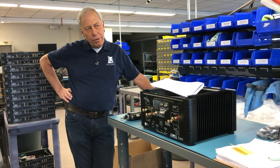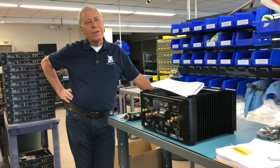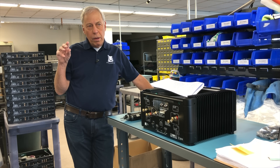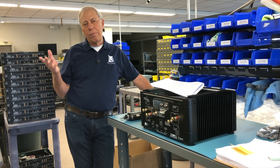There was a time years ago — I remember an old David Hafler amp that had back-to-back Zener diodes, or actually I think they were parallel, across the input with a capacitor on there. It was sort of a soft clip that would protect your speakers and the amplifier from any kind of damage from being too loud.